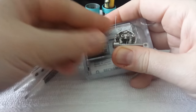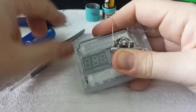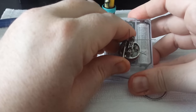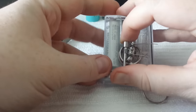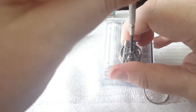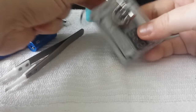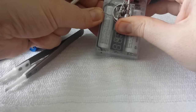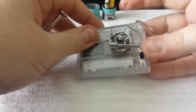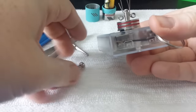We're going to use this post again to get it in there where I want it — you don't want it touching the posts but you want it fairly close. I'm going to use that ledge just to start to bend the wire. Instead of bending it before you put it in, which can put kinks in your wire, I like to bend it once it's already in there. It makes it super easy and fast. Now that I've got it where I want, I'm just going to tighten down the screws.